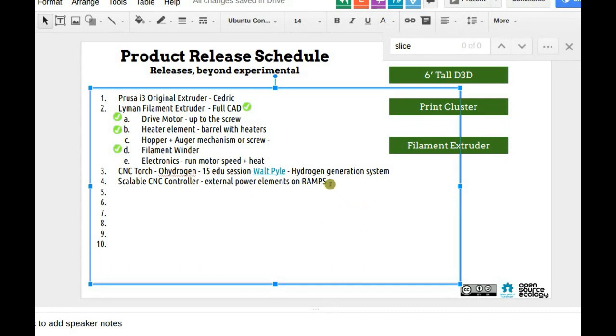And the ultrasound sensor. So we will have to do a torch height control on the CNC torch. It would be nice if we can use the same one as on a printer, but unfortunately the thing on a torch table is that you've got heat, flames, smoke, so you can't put the sensor next to the nozzle, it'll burn it. So the industry standard for the highest performance version of that is ultrasound height controller, and I believe that's a single controller that can detect it.